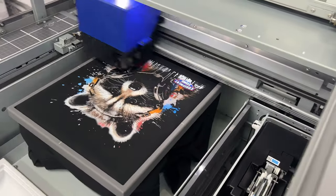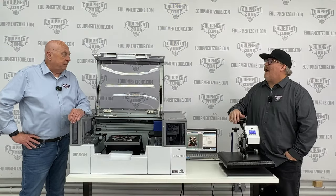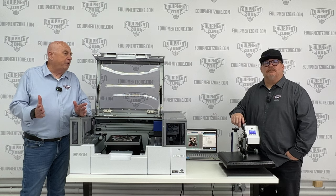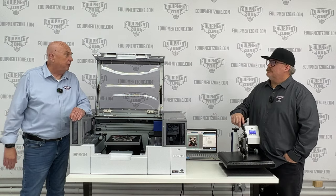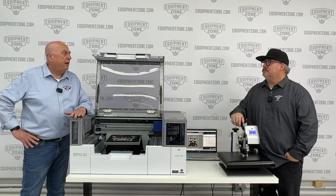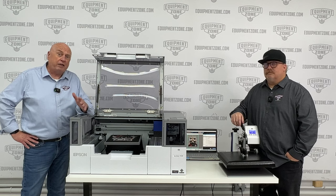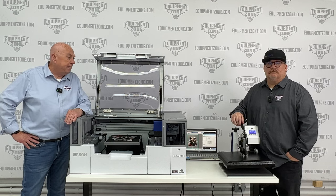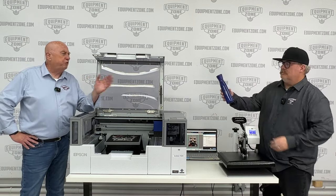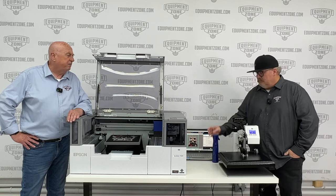These are still going to require some pre-treatment, pre-production. How are we going to handle pre-treatment with a printer like this? For most of the printers we have, we use our SpeedTreater TX that we build right here in our facility in New Jersey. We don't necessarily expect this person to buy an automatic pre-treat machine for $4,000. They'd probably buy shirts that are already pre-treated — there are more and more of those on the market. Or even using a mist sprayer. If you're just doing a few shirts, you could use a mist sprayer available at Walmart or Target or someplace like that.